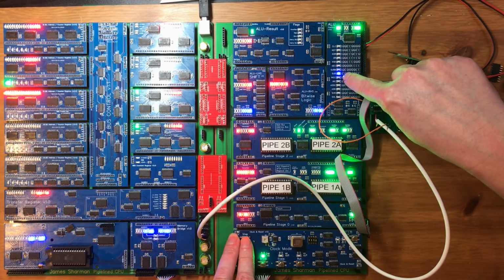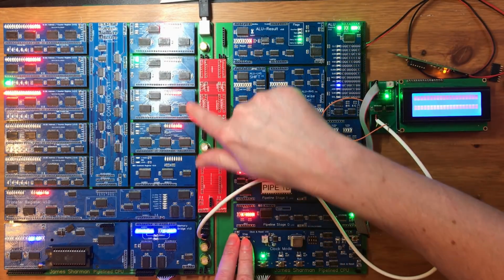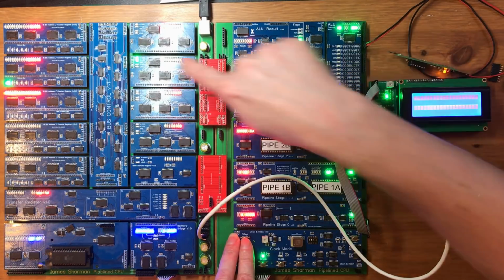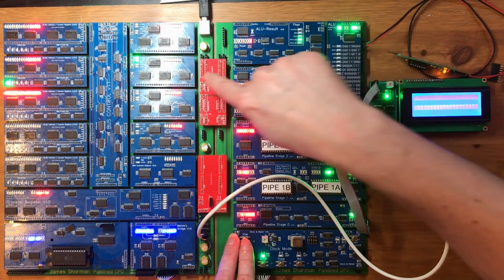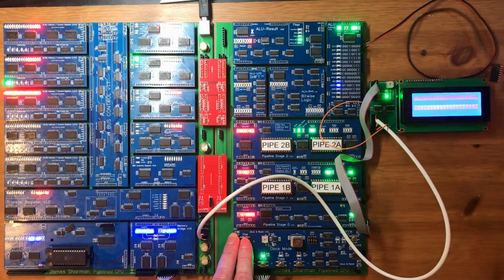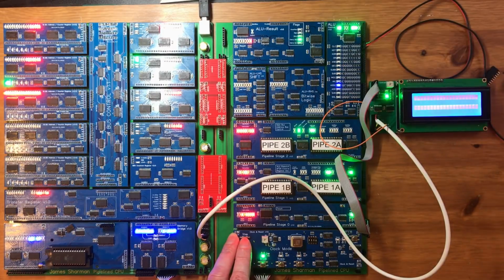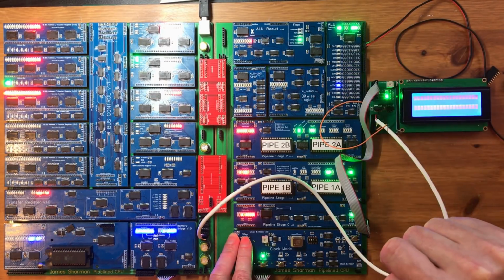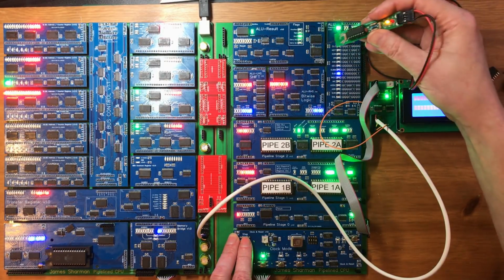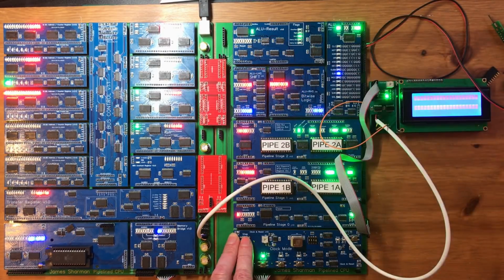So that's the subtraction. So we've got a result of 1 here, which is correct. Now we're on the add with carry, which is basically add with carry b comma b, so that's basically just adding the carry flag into this value, and that's the bit that's not working. So carry select for the next operation is 1, so 1 should be previous carry. 1 0, that's right, but that hasn't worked. So we added 0 with 0 and the carry flag and got 0.